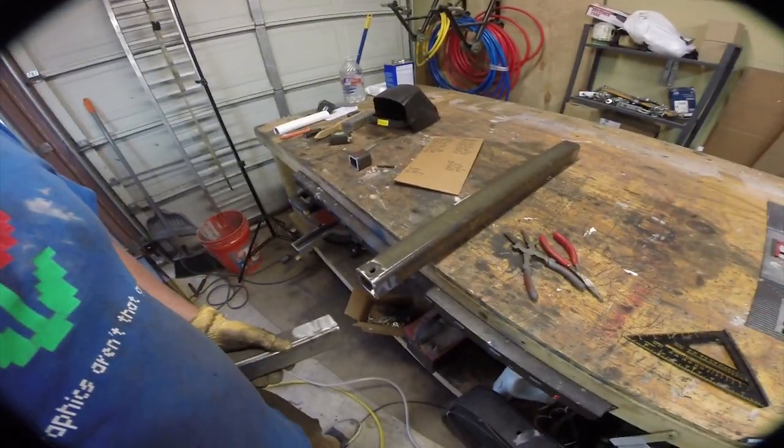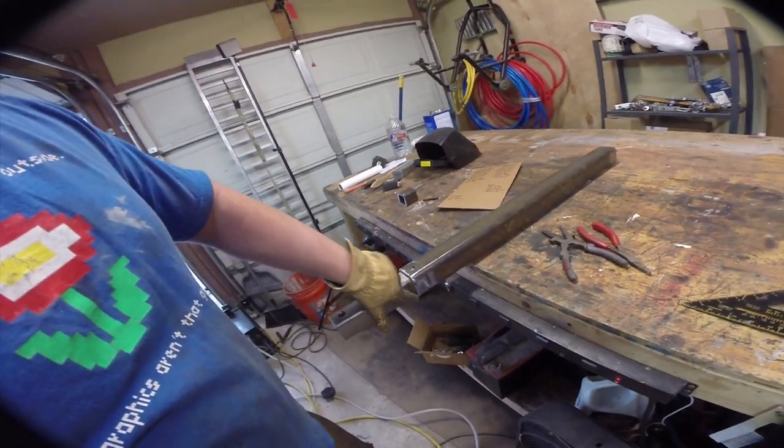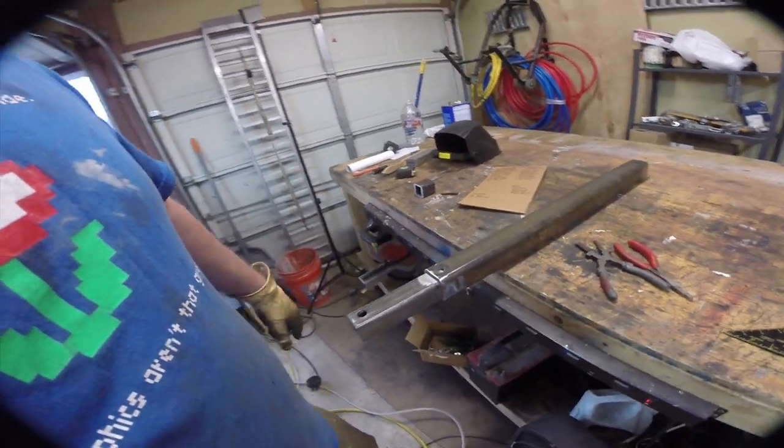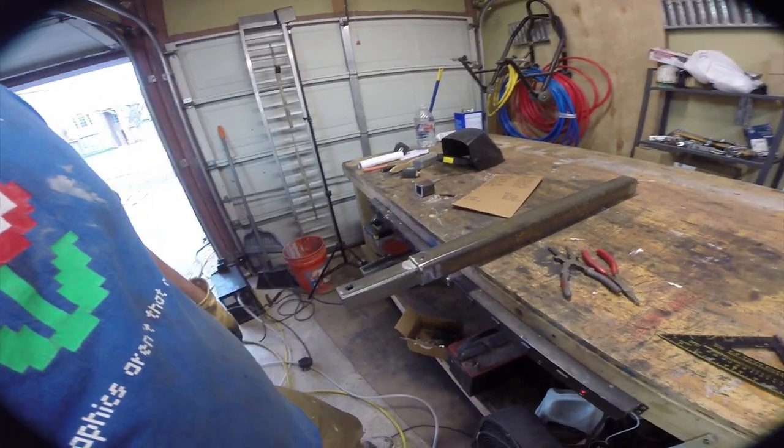I've plasma-cut some holes — they're pretty rough, not for a pin. Basically we're gonna weld this along the perimeter here and also do two rosette welds, or plug welds, in here — that'll help make sure this stays locked together. This tongue is obviously removable. The upside of a removable tongue is it takes 38 inches of length off your trailer, which makes storing it easier. Also, there's no standard piece you can put in there because I made the hitch part extra long — so you can't steal the trailer without the tongue attached. You'd need knowledge, foresight, and the ability to hook it somehow. It's a little bit of a safety feature and a comfort feature.